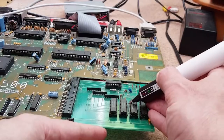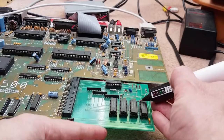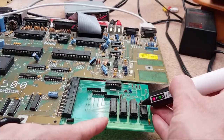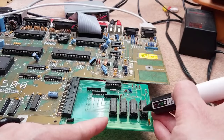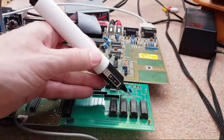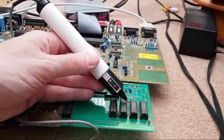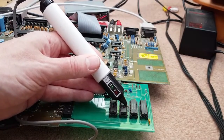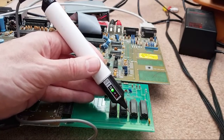It's pin 5 again. Go to this side here in a second. It's pin 5 again. This is going to confuse me, this one. Like I say, though, I've replaced the sockets on this one already. Oh, hang on, we've got one missing there, look. There we go, that's the issue. Sweet, so the logic probe has fixed the thing again.